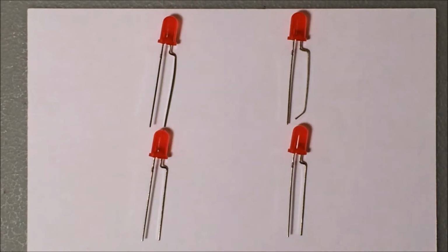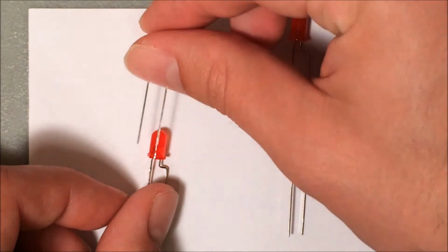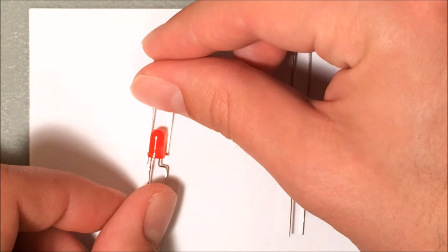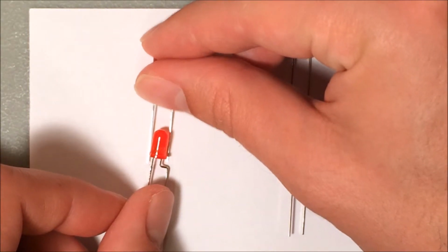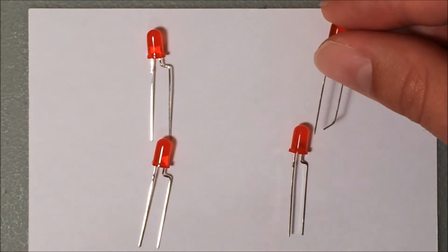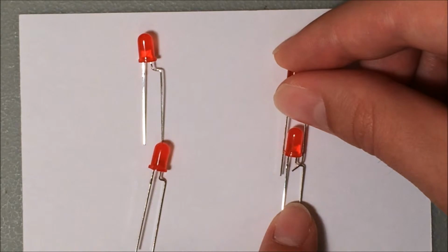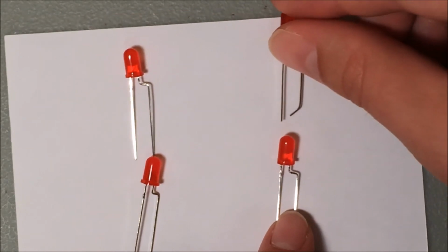Some users may feel that 2 bends in the lead is all you need. So as you can see, with 2 bends, you can safely pass around the LED of the lower layer. So when you solder these together, you can in fact make this connection. However, I like to put a little 45-degree bend back towards the center, so I actually give myself a little bit of a cross as I make these layers, so I have an easier joint to solder.